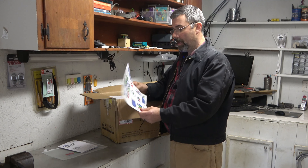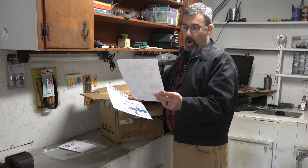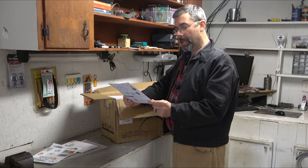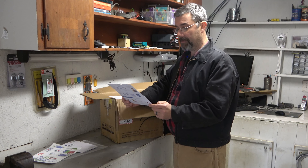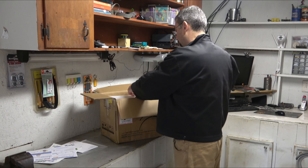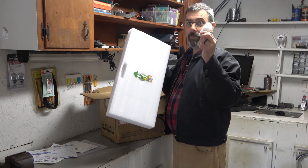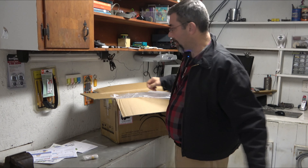It also comes with some stickers — for your camper, RVs, and houses as well. For long-term storage, recharge every three months. It's recommended to be stored between 10°C and 35°C, which is 50 to 95°F. I can tell you we're well below that today — you can see I've got a jacket on. There's also a little sticker telling you: don't throw away the foam, because the bolts for the top of the battery are in there. I appreciate them doing that because I probably would have thrown it out.